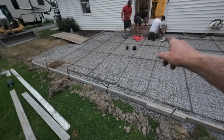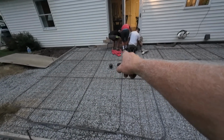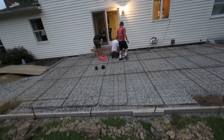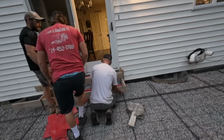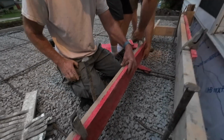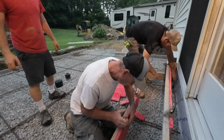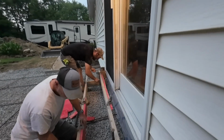Look, our drains are set to height, the clean out for the sewer and the fresh air for the sewer. Just putting a step liner on, trying to cover this stuff very quickly. I'll check it with the form again. So that's our broken stone liner. We have it in 6-inch, 4-inch, 2-inch, 7 1/4 inch. Pretty much all your broken stone needs.